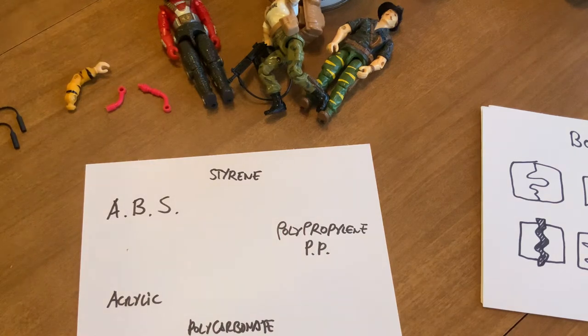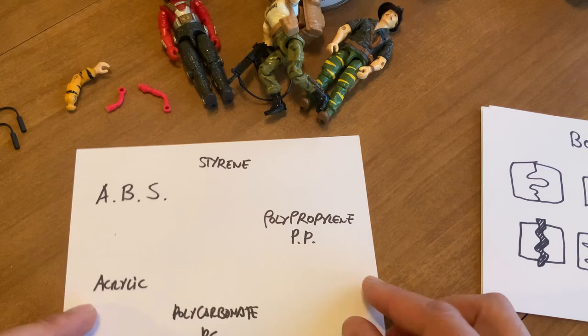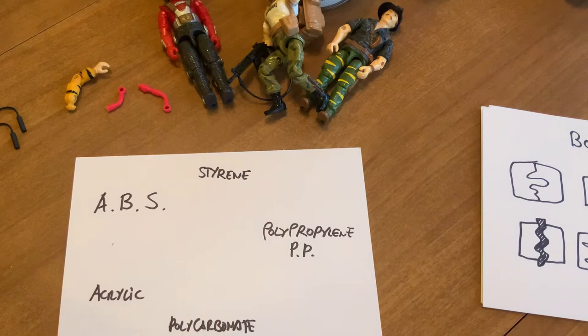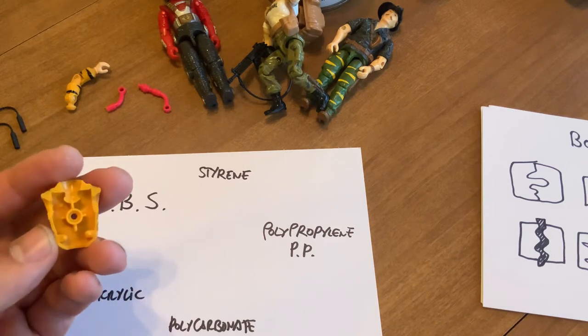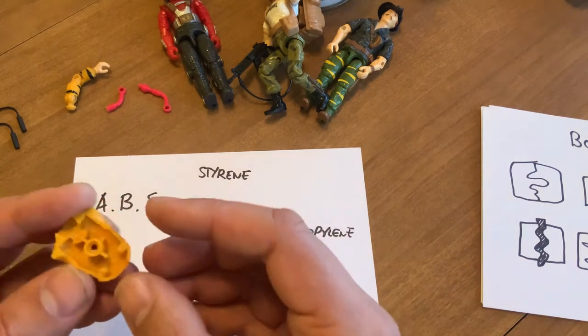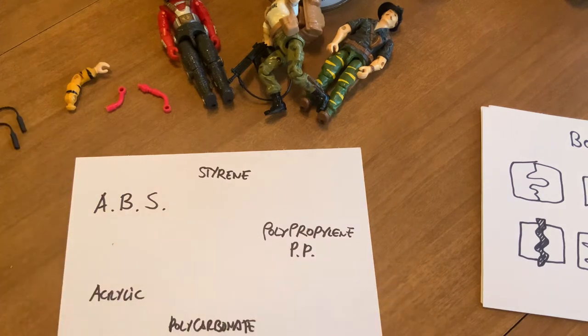Plastics as-is are not supposed to be like pottery. Acrylic for example is very crisp and transparent, but it breaks — it's brittle like glass. When we want plasticity, we want a bit of give, some strength, and stability over time. In the composition of ABS, depending on the application, we want strength, specific color, and resilience to temperatures. When the plastic cools off it shouldn't warp as much, assuming it has even thicknesses.